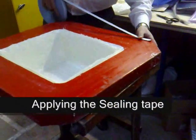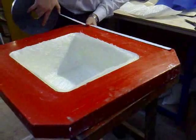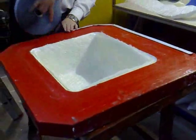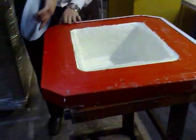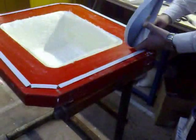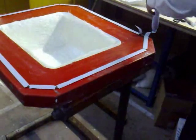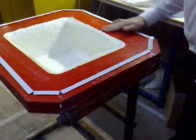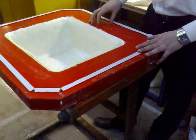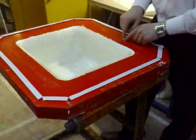I'm going to apply it quite close to the edge of the mould, purely so that we've got room for break areas and so on. What I need now is some sort of core mat or something that we can use to put around in the break area, because I'm going to put a vacuum track all the way around the edge.